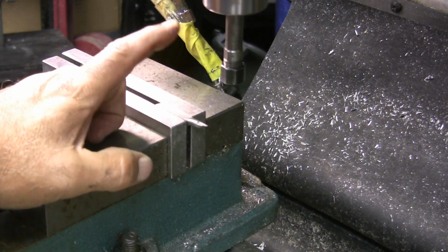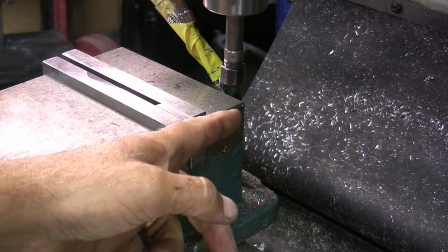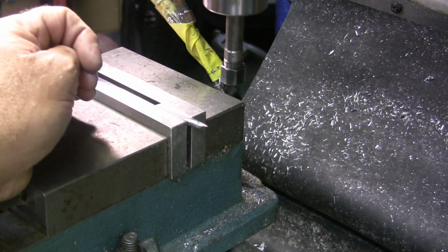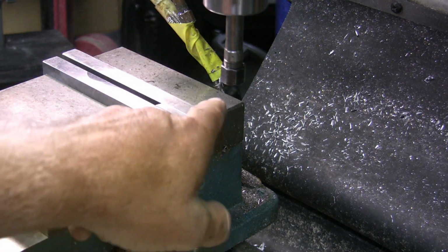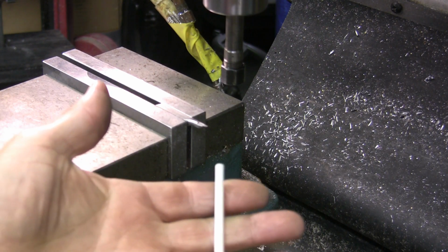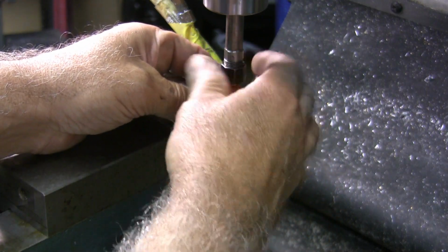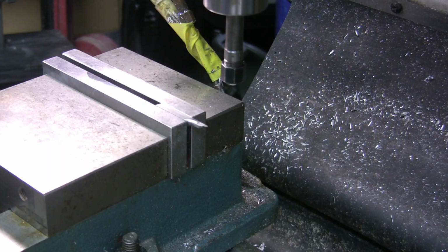The tool bit is set up, and this is Y0 and X0, and that's the tip of the tool. Right now we're setting off a 0. I'm going to return it back. I'm going to put a piece of material in first. I have one little piece left here. We'll stick that up in there. Just snug it so it doesn't fall out, and then we're going to return to 0.